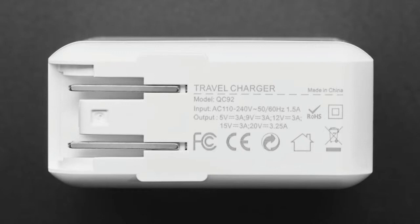The last few years, we have been working as engineers to replace those power bricks with USB Type-C. Here's a USB Type-C laptop/tablet/phone charger that can charge almost every device. On the output it can do 5, 9, 12, 15, or 20 volts. This is a nice chunky power supply — it can do up to 65 watts, 20 volts at 3.25 amps. So you can power a small laptop, a big tablet, any kind of phone, any kind of watch, any device from the house.